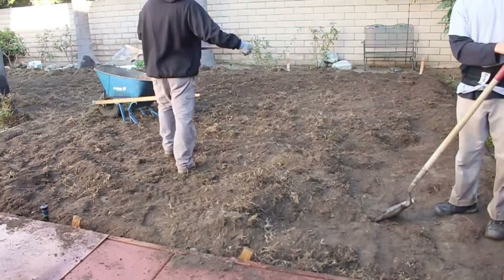That's about three and a half yards of topsoil we brought in. Now we're going to adjust these sprinklers — that one broke from the wheelbarrow going over it, so we had to repair it. Once we get this dialed in, we'll run the sprinklers and flood all this again, then let it settle overnight. After that we'll touch it up, see where it settled, regrade, and then lay sod. It's a lot of process and a lot of steps — you could probably skip them, but you may run into problems later on if you do.